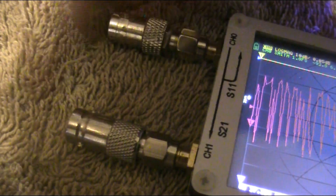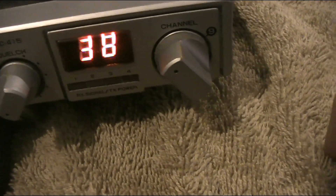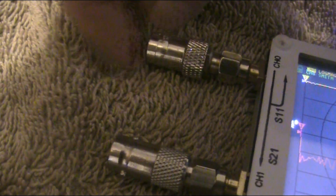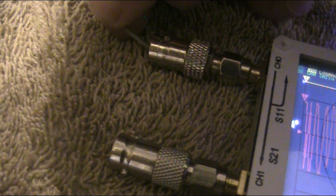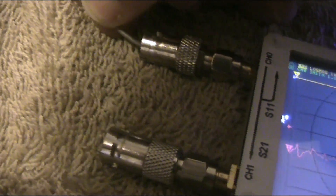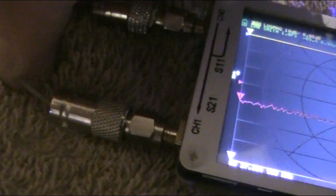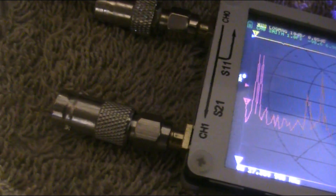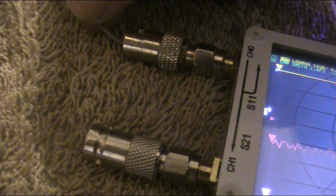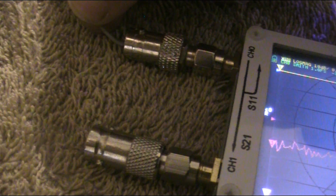So we need to apply a bit more RF going into the receiver. In this case I've got a coaxial cable antenna, so I'm not going to break that open. Let's see if I put a little bit of wire into the antenna socket — then we might be able to resolve the signal. Now there's channel 1 there. Something happened but it's still not resolvable.